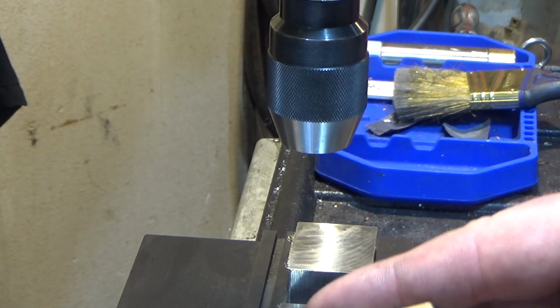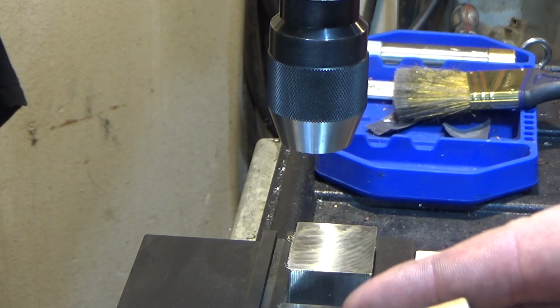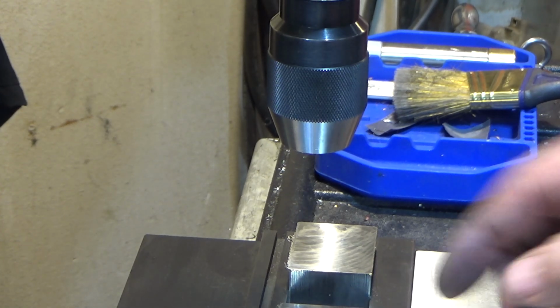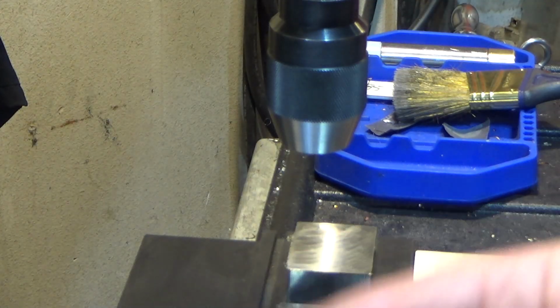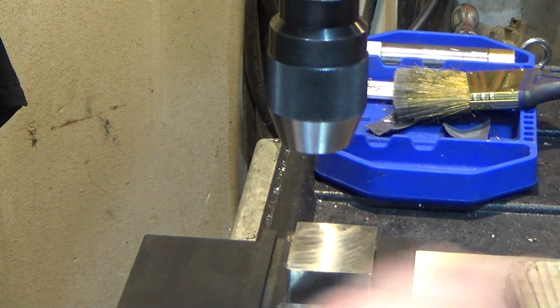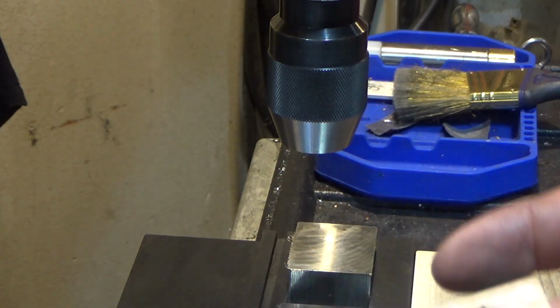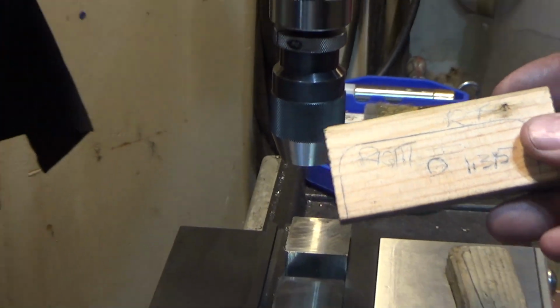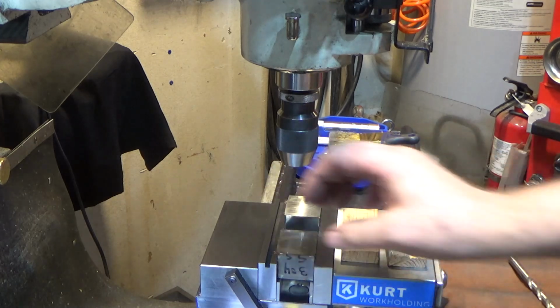So I measured this on both, and it's a little over 0.5 on both. One's bigger than the other. So I'm going to go 450 thousandths in. That way, when this part pushes in, it won't touch the battery, because on the base of it, where the angle bracket is mounted, there's an inconsistent weld bead that goes across there. So instead, we're just going to drill these guys at 450 and leave a little slot.